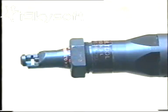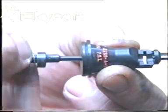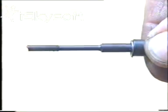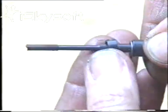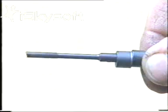Installation depth is set using spacers and shims. Remove the front end assembly — watch out for left hand threads. Unscrew mandrel from pre-winder. Slide on the correct spacer set. Add or remove shims to give the correct insert depth. Reassemble and check setting. Add a shim if the insert is too deep. 0.5 and 0.25mm shims are available. Watch out for countersinks.